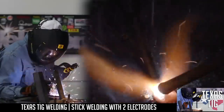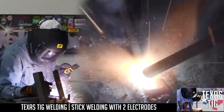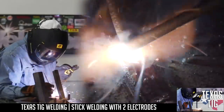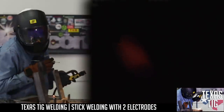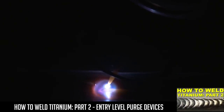We took the coating off of the stick electrode and just ran it as a bare wire. When I struck the arc on that, I was able to just keep feeding it in there, and it's got a little bit different profile to it. But the reality is I'm real close to the liquidus at 3,000 degrees.